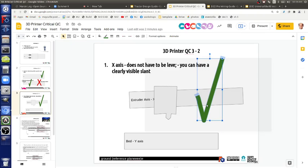i.e., the nozzle hitting your print, because there will be little inaccuracies, little blobs. You might have a little bit of filament, like when you do filament retraction, a little gob spat out that shouldn't be there. It'll freeze, it'll get solid, and plastic is 4,000 PSI or so. It's 1/10, maybe 1/20, of steel. Let's just say 1/10, but it is quite solid. So a tiny little blob of plastic that you hit with the nozzle can still shake up your print. So that's why you want adhesion.